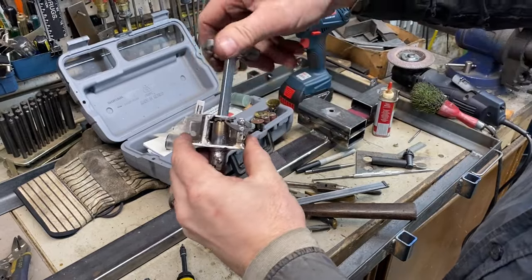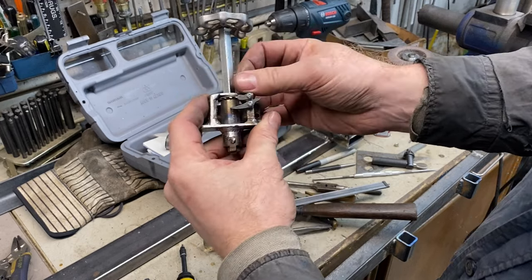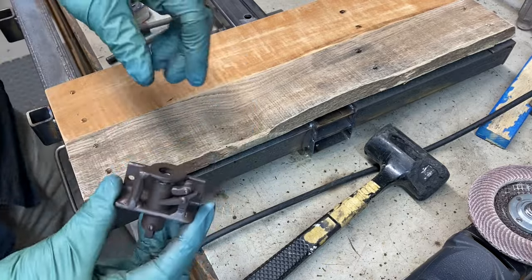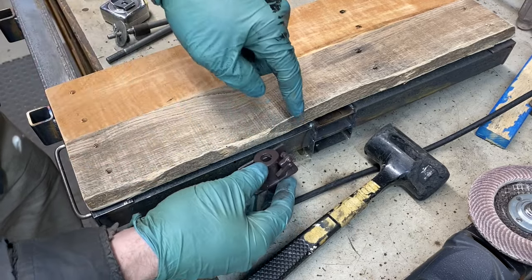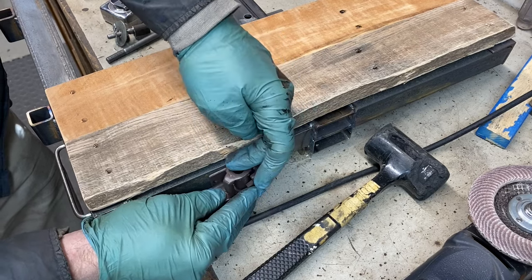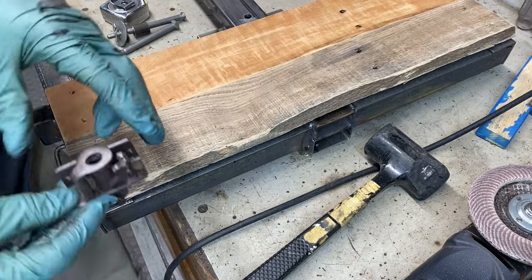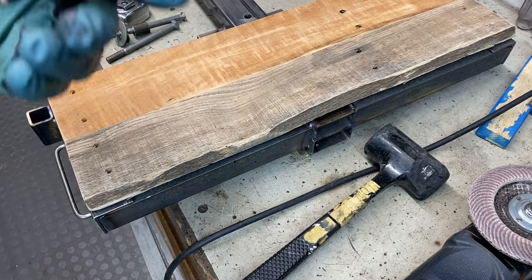There's our final assembly. You'll be able to rotate that if you really want to play brakeman or something. So we've got all the working parts - all I have to do now is drill the end of the car out for a couple of mounting bolts and we're in good shape. The next step is to get this handbrake assembly attached to the end of the car. I measured the other one and it's about five and a half inches on center here, so I indicated a mark there. We want the top of this assembly to be at a height where the handbrake wheel will sit flush with the deck when it drops down into the little recess. I just used a Sharpie, put two little dots there marking out these two hole locations, and we'll drill those and get ready to attach this.